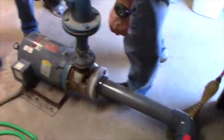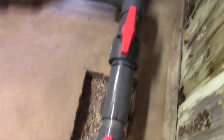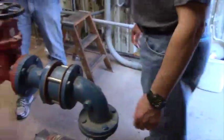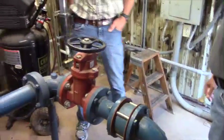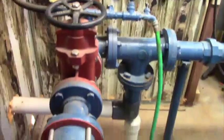The water comes in from the tank, up from underground. Both pumps are open and operational — they alternate their use. If one fails, the other takes over. If one can't keep up, both will start.